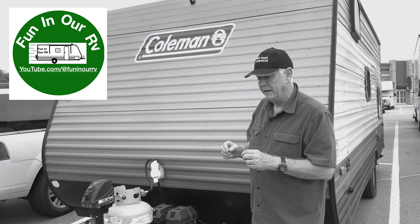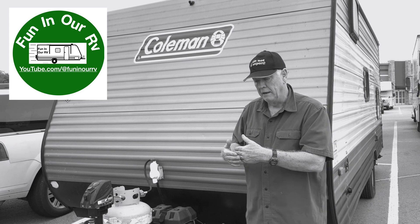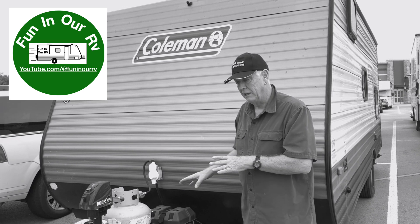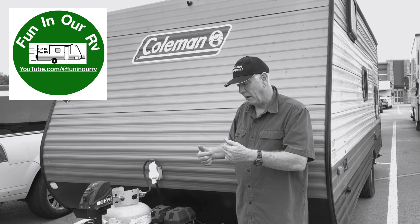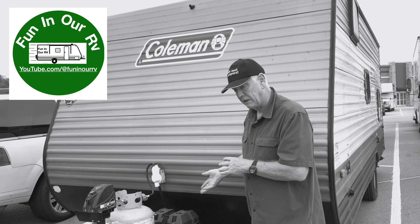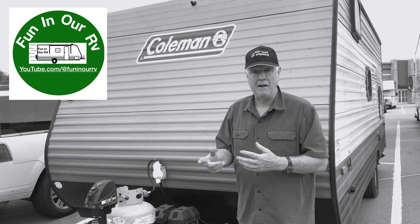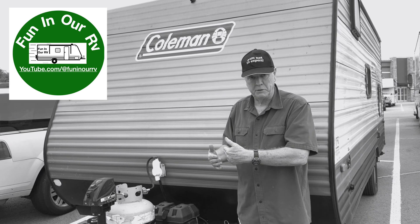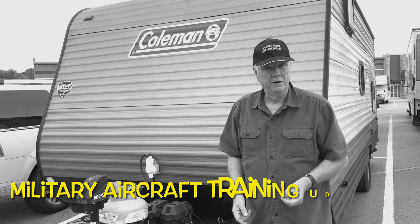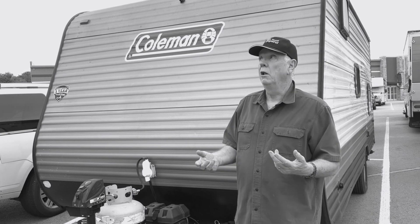The other correction: I installed this the same way as our old red switch — with the bolts pointing outward, leaving the small smooth bolt heads inside with a piece of masonite to protect the battery case. That worked with the old ones, but with this one, if I had it to do over again I would put the bolts in from the outside as intended, then cut them with a hacksaw so they don't stick through more than half an inch. It's much easier to get them tight that way.